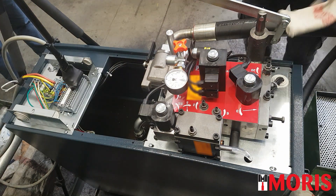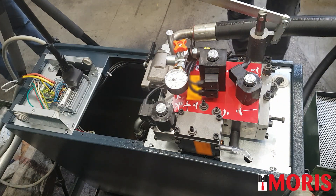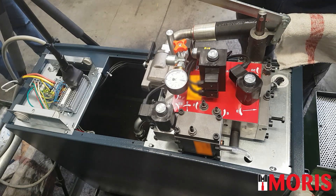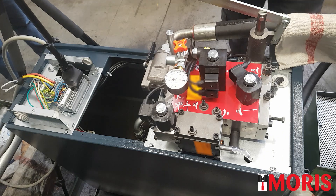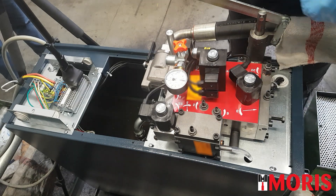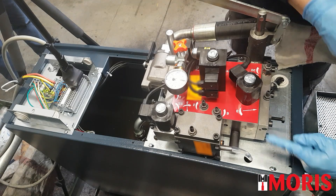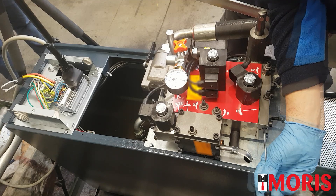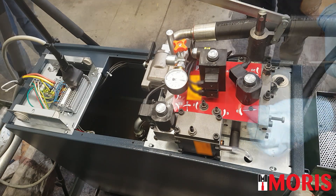If the problem does not disappear, we have to verify lateral plate 0-4-4-8. Bring the cabin to the lowermost floor and put the elevator under maintenance mode. With the screwdriver, remove screw 5-4-5-3-9 positioned on the side of plate 0-4-4-8.